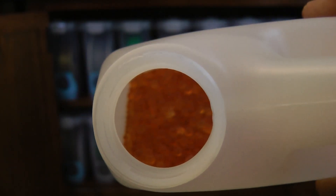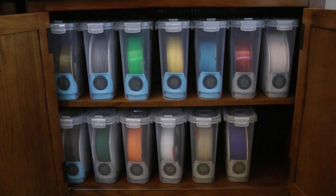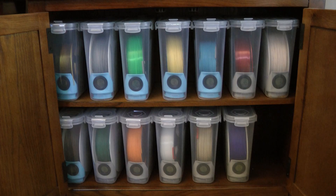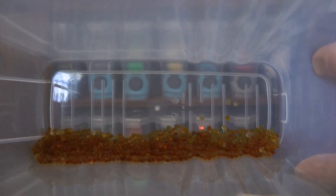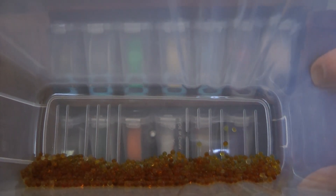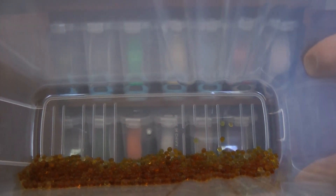So I've got the orange ones. What happens over time is, as they absorb the moisture in the air, you can see here how they have turned a darker color. These are still good — they're not super dark yet. Eventually they're going to turn almost a very dark green or almost black-looking color, and that means it's time to recharge them or dry them out.